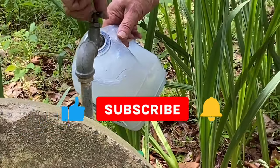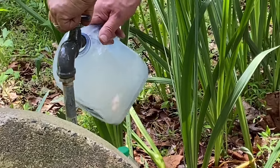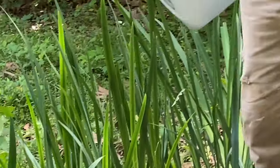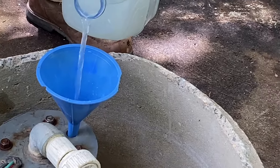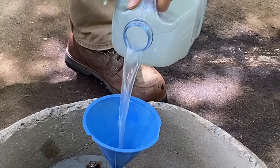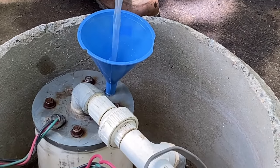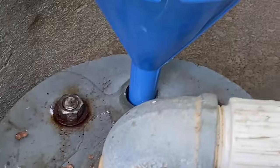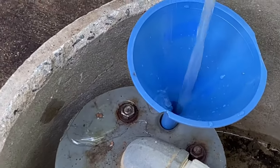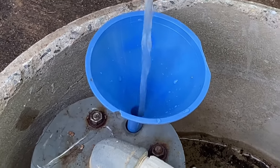All the electricity is turned back on and all the connections are made. The water is now flowing. But what we're going to do now is sterilize the well, since it's been opened. We'll use some pool shock — pre-dissolve about two tablespoons of pool shock in a couple gallons of water — put it in the well, and let it sit in the well for a period of time, fifteen minutes to a half an hour.